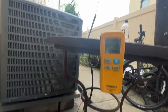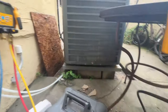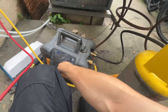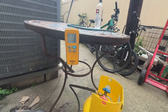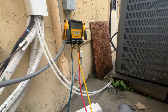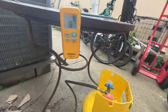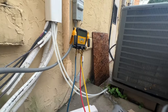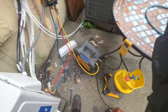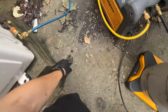Our recovery process finished at just above two pounds. We got an extra ounce and a quarter in there. If we self-purge our machine, we should get about another ounce, maybe two. We pulled into a vacuum, so we don't have to worry about the lines having refrigerant in them. We can get started with the indoor unit, which I've already taken apart somewhat, and we'll just disconnect the lines. I'm hoping we won't have to extend the lines — I'm hoping there's enough there, but we'll see what happens.